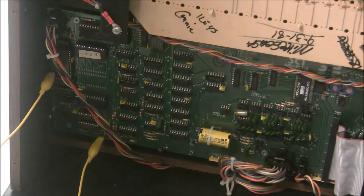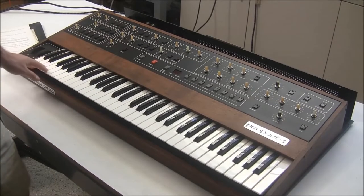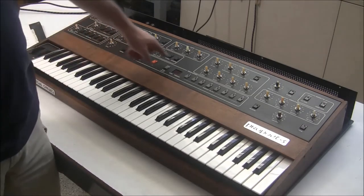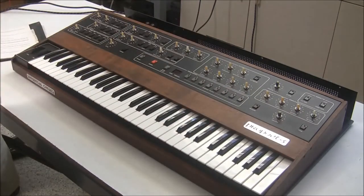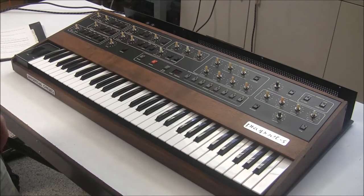We're looking at board 3, the CPU board. In order to access this test we have to install a jumper between test point 304, labeled as memory test, and the 5 volt rail. Conveniently there's a little part here where we can clip to — they made the 5 volt rail easily accessible. Then we can turn the keyboard back on. According to the service manual, with this version of ROM and that jumper in place, when I turn it on it'll go to the memory test, flash the LEDs on the panel, and when I hit the tune button it should test the scratch pad RAM, non-volatile RAM, ROM, and timer, and let me know if there's a problem in any of those areas.